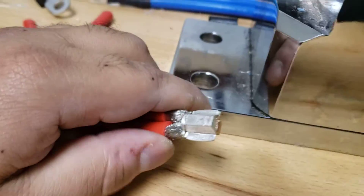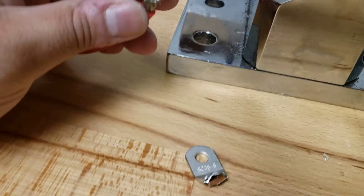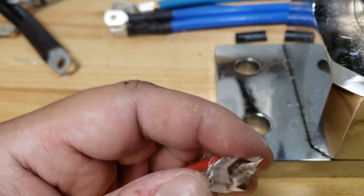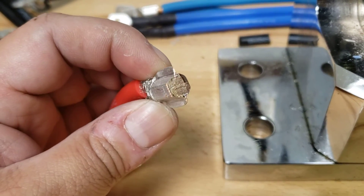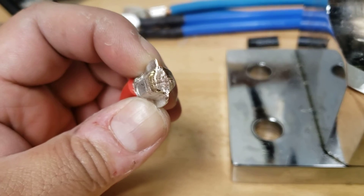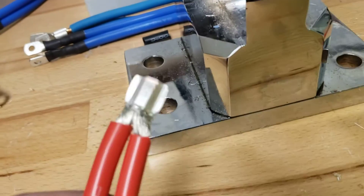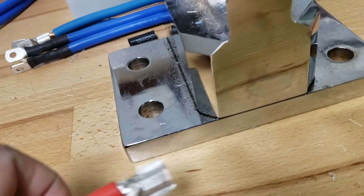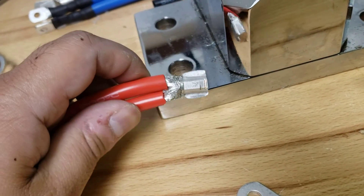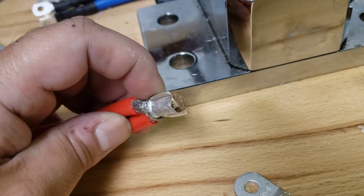There is basically — all those strands almost merged into one solid piece of copper. Do you see how there's no gap? That's what is actually making contact. We want to do that because we don't want any empty gaps — we want end-to-end coverage to where it's basically perfectly solid. Once you have it covered with some heat shrink, it'll look nice. But you will have a very solid connection, no gap, it's not going to come off, it will handle thermal expansion — it looks like it's one solid piece of copper.